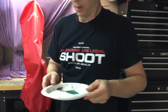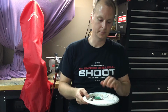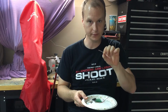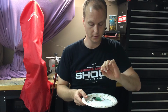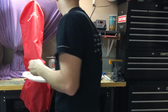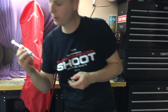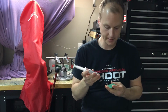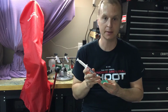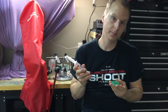All right. Also pulled out some paper plates. These things are not easy to get out of here, from what I've watched in the videos, and to get them upright. So the idea that I'm going to start off with is I'm going to use just a bit of solder paste on a pad, and then I'm going to use the tweezers to properly set a component on here, and then I'm going to heat it up with the chisel tip.